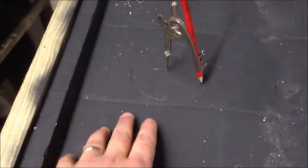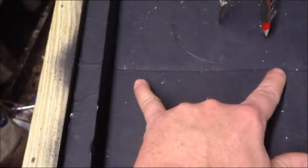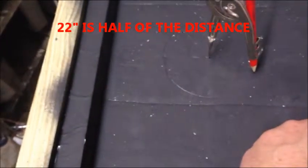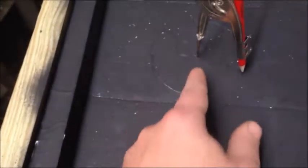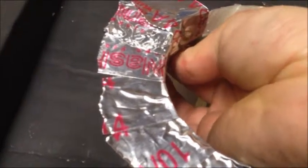Okay this is the top end of the collector. What I did was measured the distance between the first two boards and split it in half — measured the distance across which is 22, and this is nine across here, so four and a half and 22. Put the dot there. This is a compass making a four-inch circle for the pipe — spun it around and now I've got my mark where my pipe is going to come through. I'm going to cut that out, then use foil tape and seal it up. I'm just taking a piece of foil tape, overlapping it with the piece next to it, just to cover up the bare foam here.